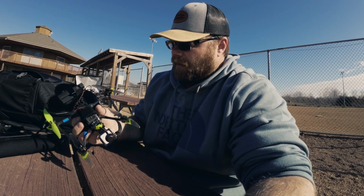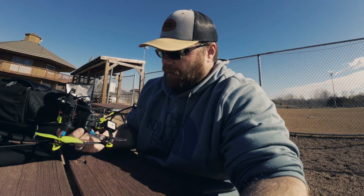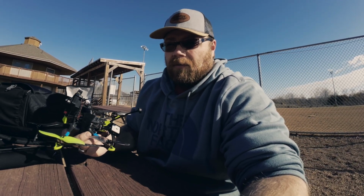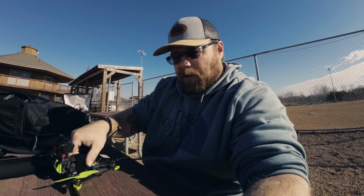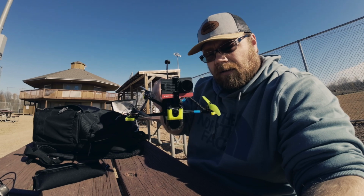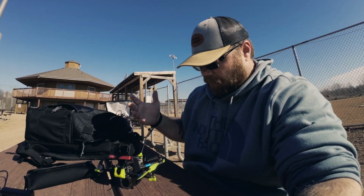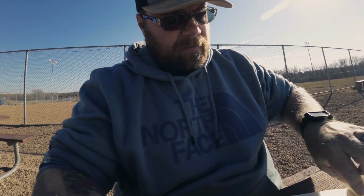The charger that I had after my good one broke didn't have an option for lithium ion, so I was charging them as LiPos, which is charging them a little too much, and I think I ended up damaging some of the cells on them, but it should be good enough for the test today. It just seems like I don't get as much flight time out of it. Running SMO 4K on it, just doing it exactly how I would normally fly it. And I also deleted the black box logs and cleared it up, so it is ready to record black box data.